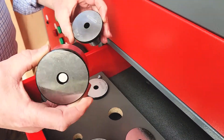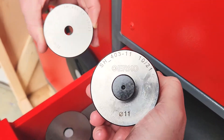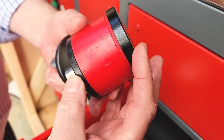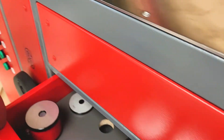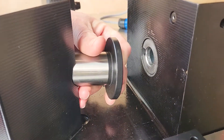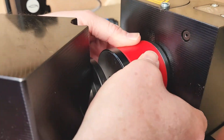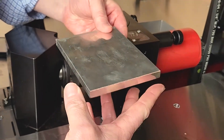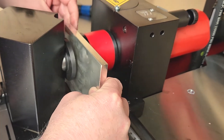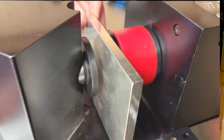See how it goes fitting into the machine. You'll notice it's engraved 11mm there and also on the back of the punch is 11mm. By the way, it's a red neoprene stripper and it bulges up as you punch the material. So putting in the die first — goes in like that, and that sits in like that. So we've got a piece of bus bar here. It's 100mm by 10mm thick, and you would slide it through and then operate the punching feature on our control panel.